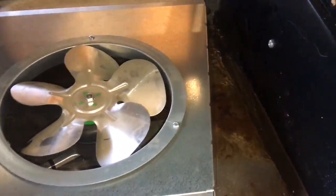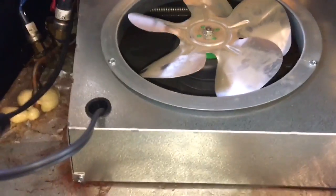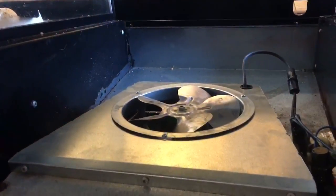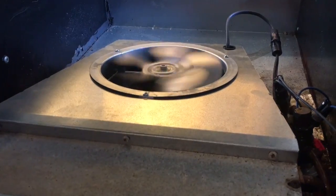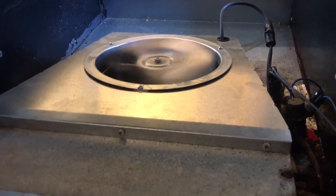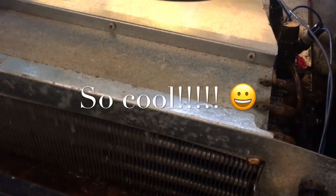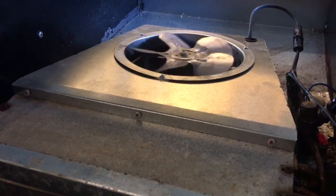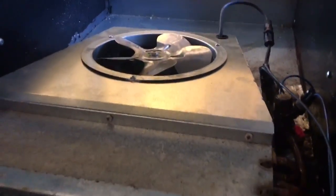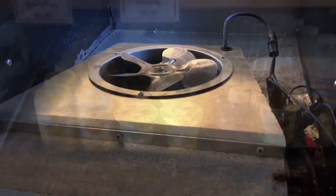Okay, we're all back together here. Get your wire connector, tape it back up, then we'll make sure it runs before we put the cover on. Turn it on here and watch the motor — it's an ECM motor. Isn't that cool? There it goes. Alright, let's get the cover back on. That won't be all noisy and jumping all over the place and rumbling — it was like a washing machine before. Look at it done. Always make your front look better than the original.